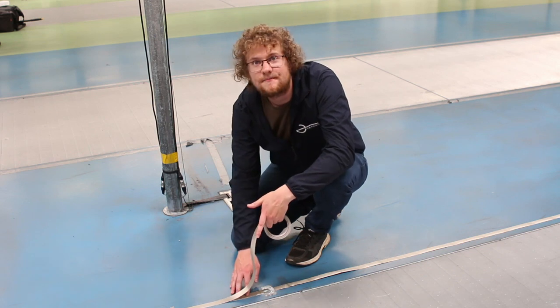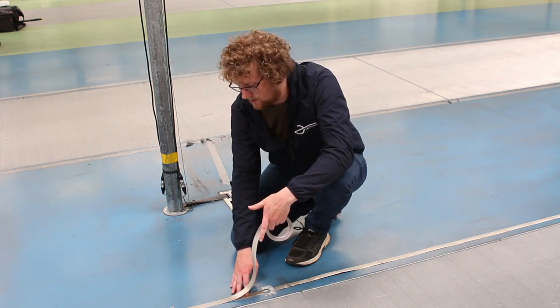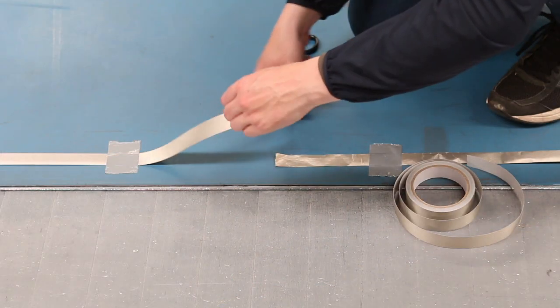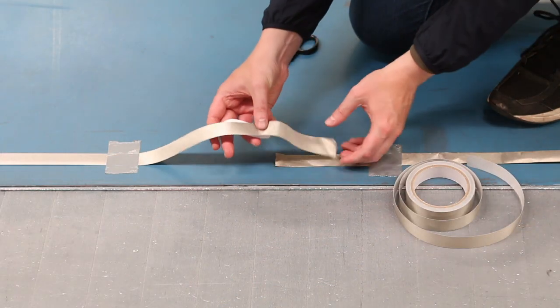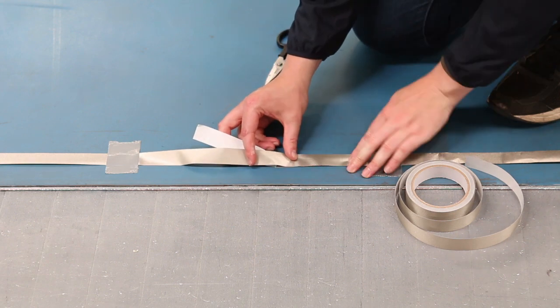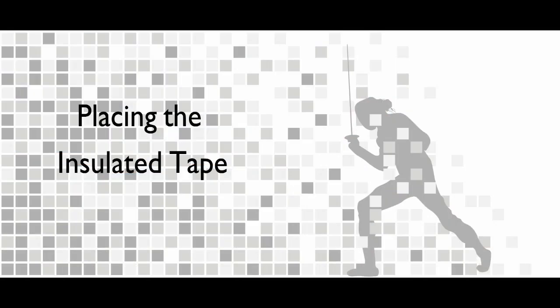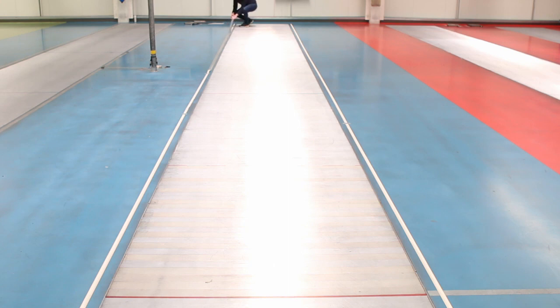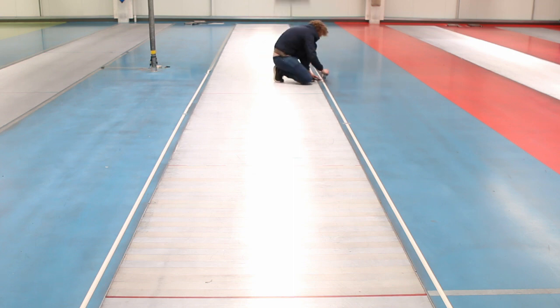So now we've reached the beginning where we started. You want to make sure that the two pieces of tape are conductively connected, so what we'll do is cut this, remove the backing and stick the top tape onto the bottom tape — this way we'll make sure we have a continuous loop. Now we're just going to tape down the conductive tape with the gaffer tape, leaving a short strip of about 20 centimetres of conductive tape uncovered where we intend to connect our piste box. We'll get back to that later.